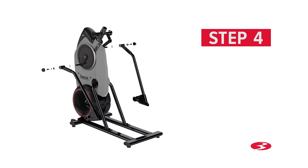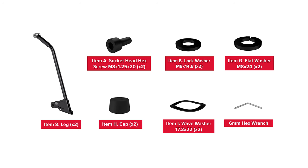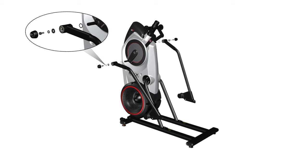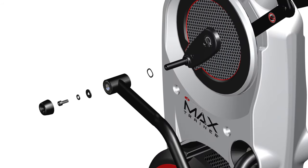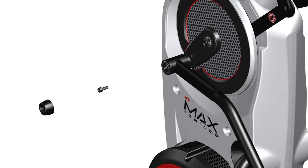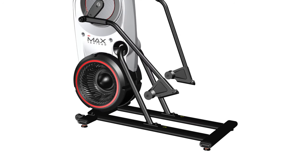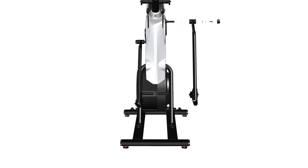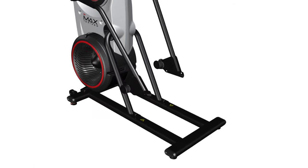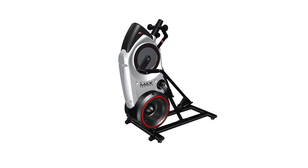Step 4: Attaching the legs to the frame assembly. Begin step 4 by attaching both part 8 legs to each side of the frame assembly. Starting with the left side, place one part I wave washer through the top post as shown before attaching the leg. Secure the leg to the frame assembly using one part A screw, one part B, and one part G washer, and tighten using the provided 6mm Allen wrench. Cover the hardware using one part H cap and push the cap into position. Let the leg rest on top of the rail assembly. Be aware that the legs are connected — when either leg moves, the other does as well. Repeat these same steps for the opposite side. Step 4 is now complete.